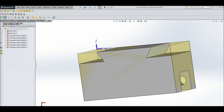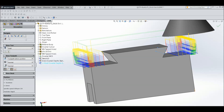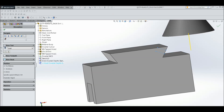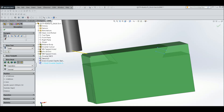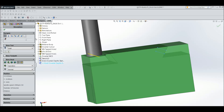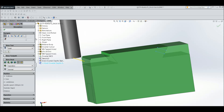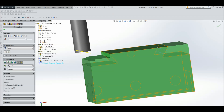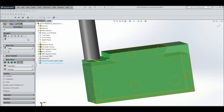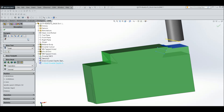If we go to simulation, you can see what's going to happen. I'll turn off the toolpath to make it clearer, and show the stock as transparent. When we start the job you can see the 12mm cutter comes in and starts carving out the open pocket at each end. It's done very gently because my machine is not very rigid, so I have to do this fairly slowly and carefully on my little machine. These are one millimetre depths with a three millimetre step over. It repeats for the other end, clears it all, then it's ready to do the dovetails.